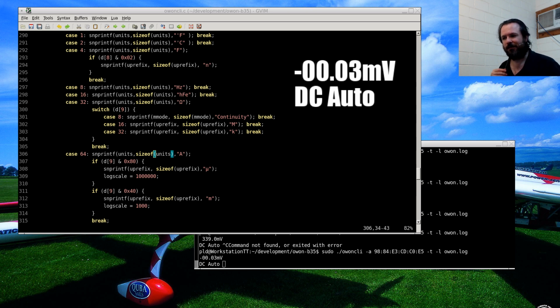There's no drain when it's turned off, and when you boot it and then turn the screen off and let it settle down, it does settle down to around about, I think, 15 to 30 milliamp, but I think it's waking up more periodically and going up to a higher current draw more often than it should. So there's something in there, and I've got to find it, but it's just one of those really niggly things. And the fact that it's such a slow drain means I can't really use thermal searching for it, so it's going to be one of those fun-to-find things.